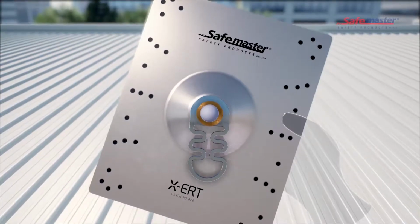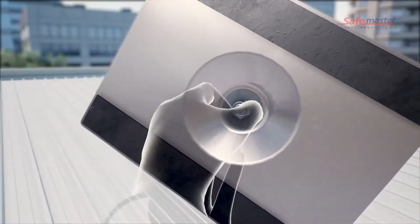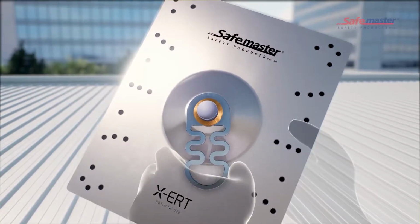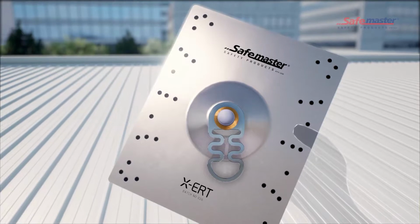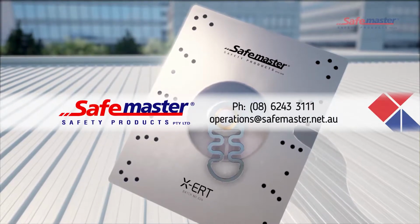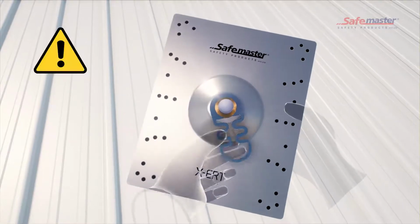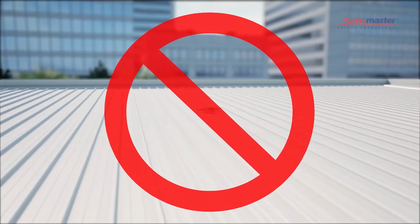Always inspect the anchor for any failures. The plate should be free of cracks. Bolt tightened with lock nut engaged. Swivel can rotate freely without excessive force or visible movement in the washers. If you suspect the components are loose, faulty, or incomplete, cease installation and contact Surfacemount Safety Products for a replacement. Do not tamper with, modify, or remove any of the Surfacemount anchor point components. Mistreating the item is not acceptable, and remember, someone's life could depend on this anchor.